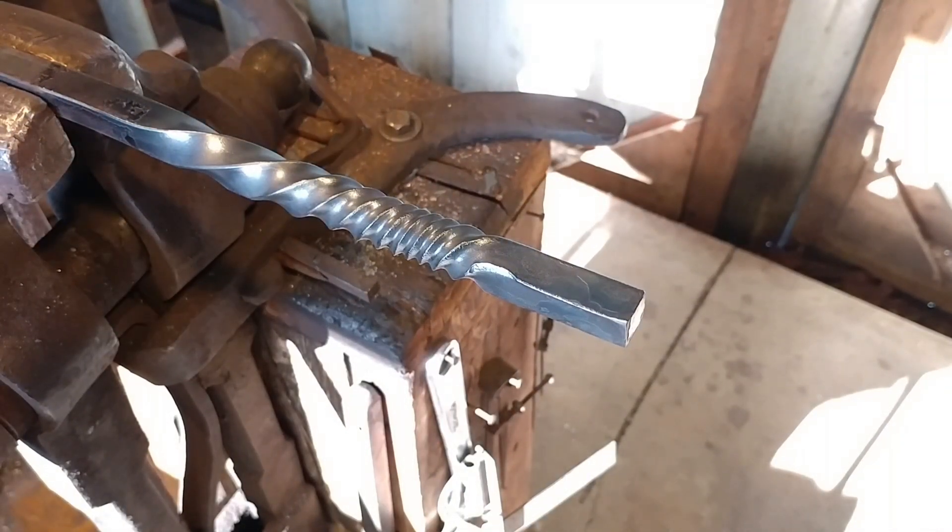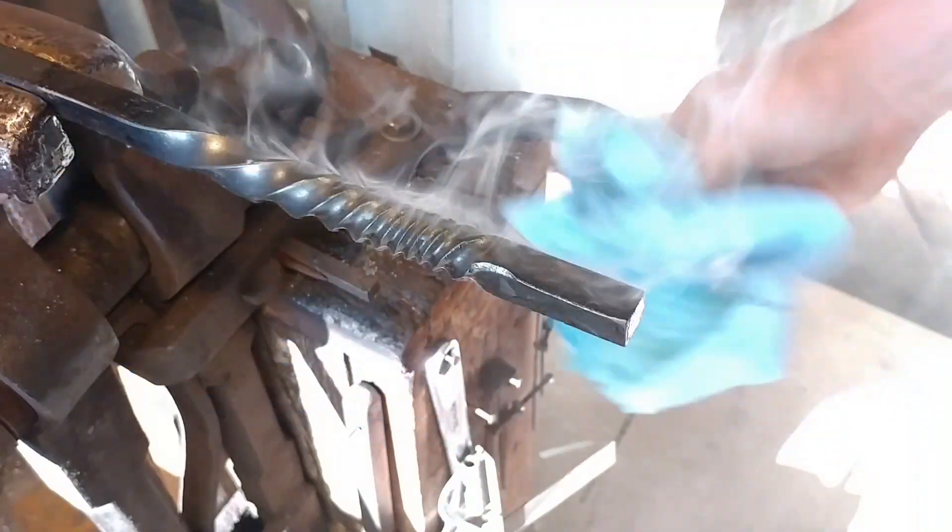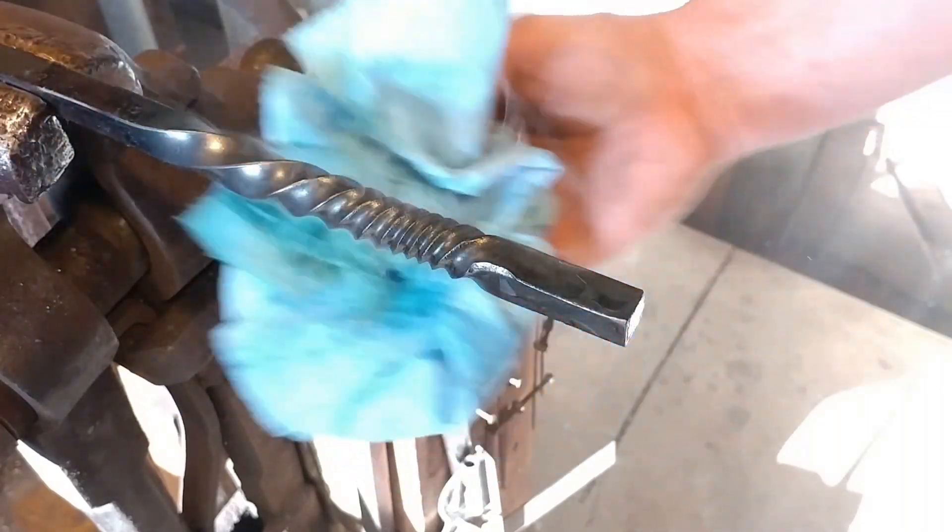As you can see, I've got a nice even heat all over the bar. The next step is to actually coat it in your oil or your coating of choice, whether that be wax or beeswax — I'm using coconut oil in this case to protect the finish. Make sure you've got a fan going, that would help. I've turned mine off so you guys can hear me, and you'll see the surface just gets a little darker at a time. Because we did the wire wheeling, that created an under-sheen to it. So it's still a piece of black metal, it still looks period and correct with a forged finish, but it does not look as rough and rustic as it could have looked if we'd just left it at a standard forged finish.